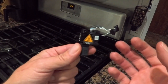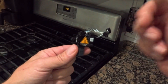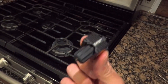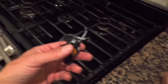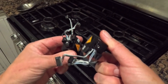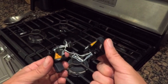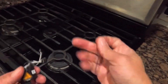On a Bambu printer, when you hit 'unload filament' it cuts it and you can pull it out, but then you're stuck with this and you can't shove it back in. Long story short, I have about seven of these that have been destroyed at $35 a piece. I thought they were trash, but I just figured out how to do a cold pull once the hot end is out of the machine.